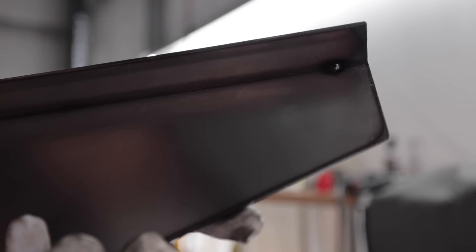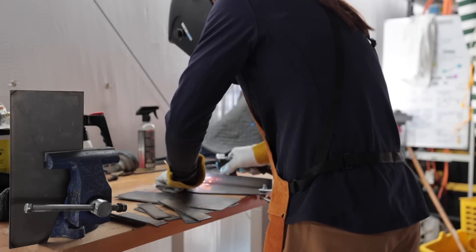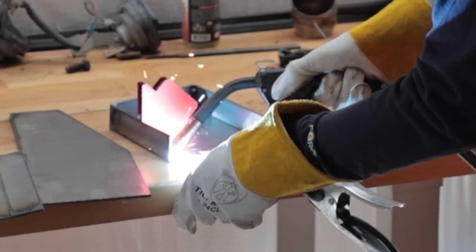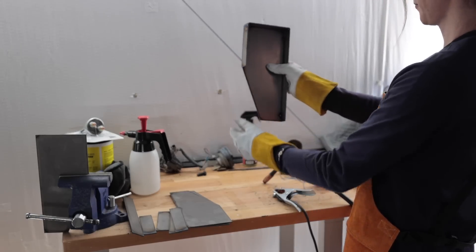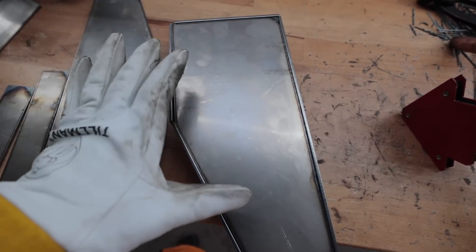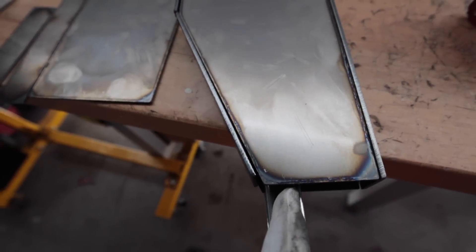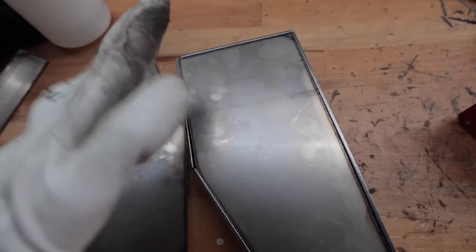I got a little tack on there and now I need to repeat this a billion times. Please keep in mind I'm an aerospace technician by trade — I never went to school for welding or metal fabricating, so this is beginner stuff. I just lightly placed this top plate down inside the sides so I could get an idea for the shape and put a tiny little bead right there and another one down here on the ends. That way the sides don't start to move around as I start welding the inside.